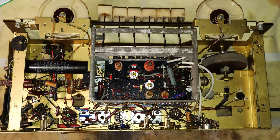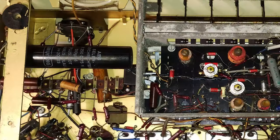The keyboard switch of this radio model incorporates the function of powering on and off the radio. This way, the radio can be powered on by pressing the button corresponding to the chosen wave band or external audio source, and turned off by pressing the OFF button. To obtain this result, a regular lever switch was incorporated in the mechanism and mechanically driven by the keyboard levers.